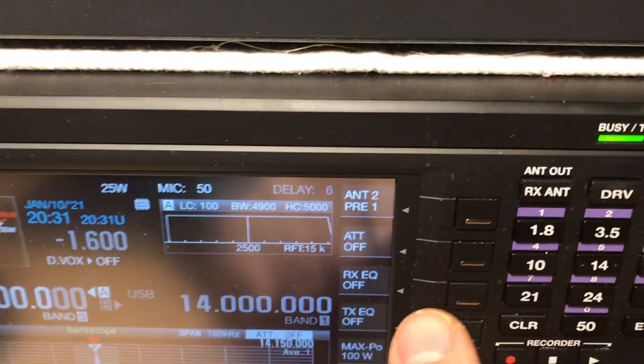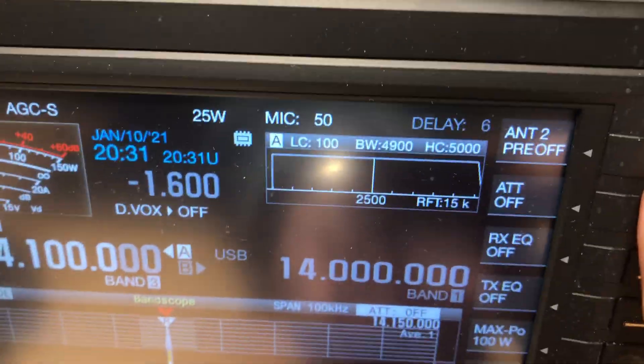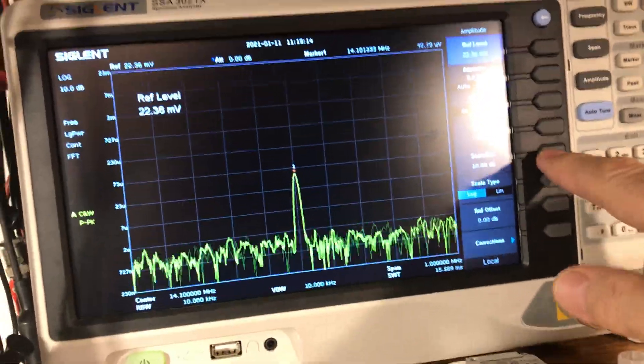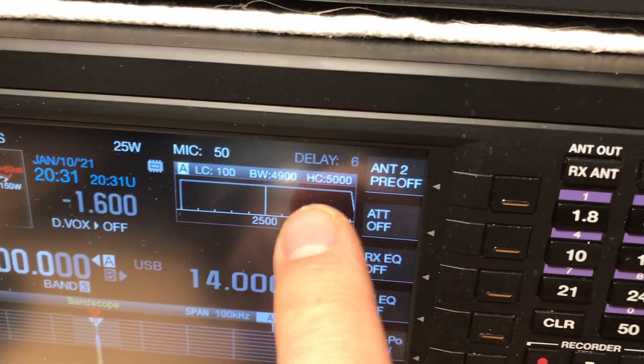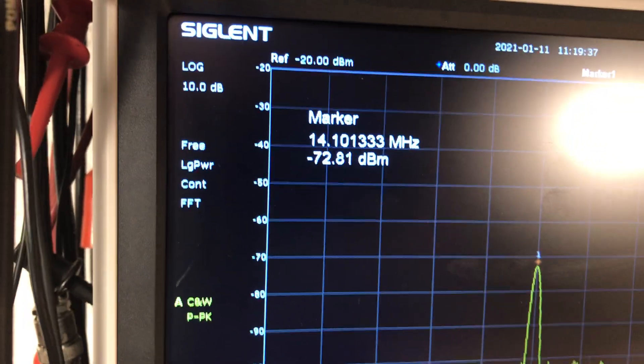Oh, that's another thing I want to tell you - this is actually incorrect here. It turns out that turning on and off the preamp on this radio affects the impedance somehow of the antenna signal. It changes the loading such that my signal will go down - it pulls down the signal source a little bit. So look at this: when I turn preamp 1 off, right there, I go back to my 50 microvolts. We'll go back to dBm - units - and peak. Okay, minus 72 dBm - that's my source signal. Now watch this - I'm going to hit preamp 2 or antenna 2. Preamp off. I'm going to hit preamp on for preamp 1. Watch that signal drop. Ready? Bam - it did not drop.